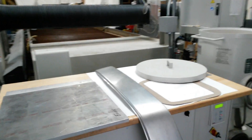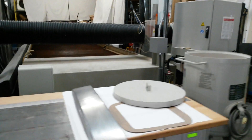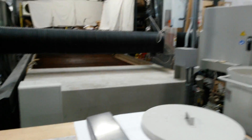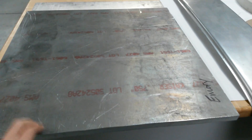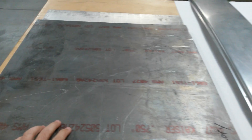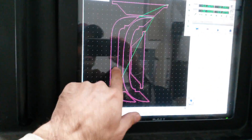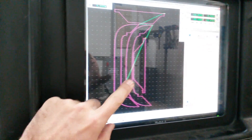Today I'm gonna show you guys my favorite tool here at the shop — this is the OMAX waterjet. First up, we're gonna cut this three-quarter inch aluminum piece, it's 6061 aluminum, three-quarter inch thick. I've been given a drawing from one of the guys here in the shop and we're gonna transfer that over into the computer. I've already laid it out and nested everything into the cut program.